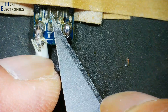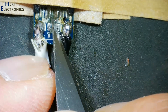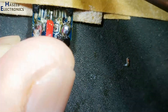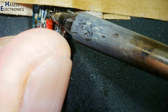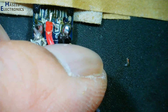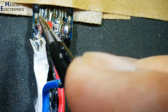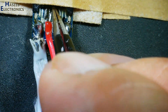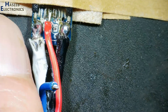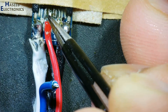I removed this pin to create more space and avoid short circuiting. I connected an extension wire to the blue wire because it is a thick wire — if connected directly, it will move and cause a short circuit with the second pin. Using the second side with the same combination, starting from the left: ground, then leave two pins, then positive, then CC pin.